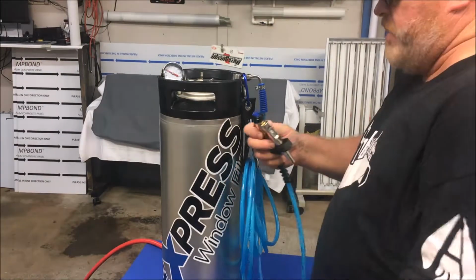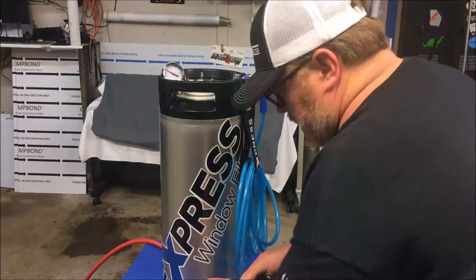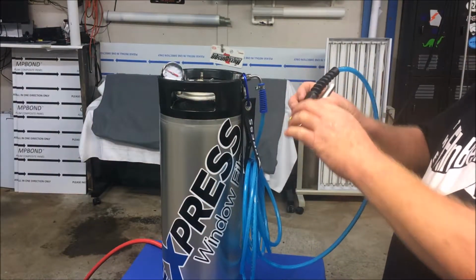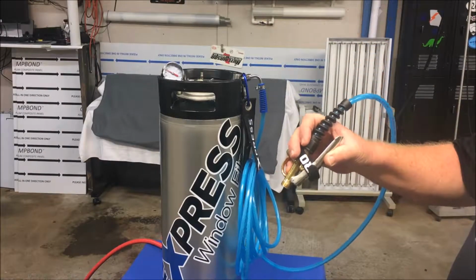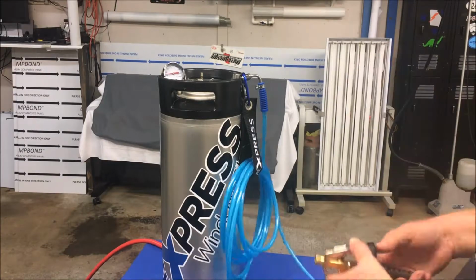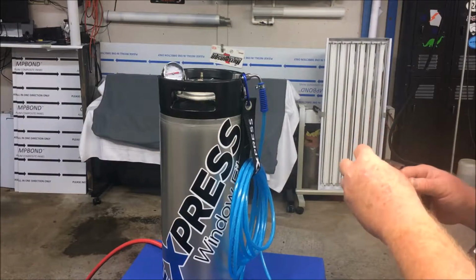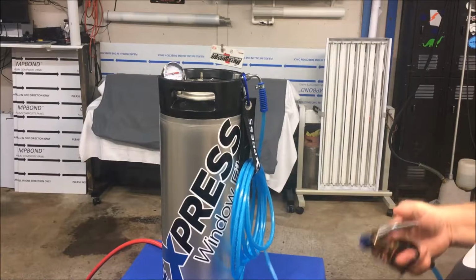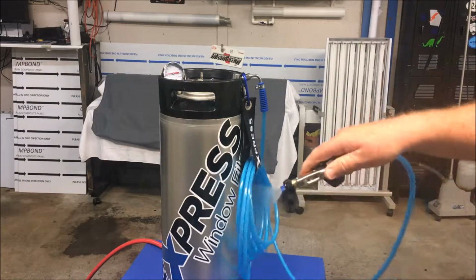Well, I think what I'm going to do is take the tip off, and we'll take the strainer out, and I'm going to see how long it takes to deplete the amount, and see if there's enough air pressure in there to deplete the whole 4 gallons. Alright, let's put it back together. And like I say, what I'm attempting to do is to show that with 80 PSI preset, you can deplete the whole tank and get all the solution out.